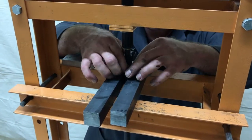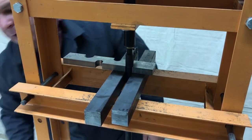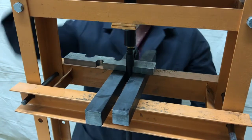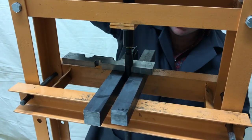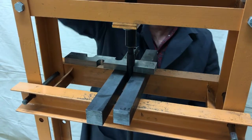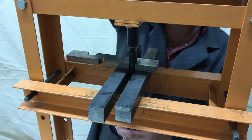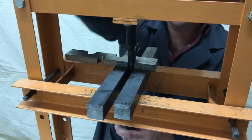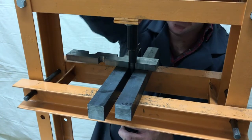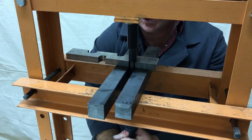That looks pretty good. I'd advise wearing safety glasses for every one of these steps. I'm tightening down my release valve, going to double-check that both pins are out — and they are. Now I'm just going to gently crank. If you hear a bunch of clanging right now, it's bad — doesn't mean it's fatal, it's just not good. I'm bottomed out here and I'm going to squeeze it — yeah, I can work it the rest of the way out now.